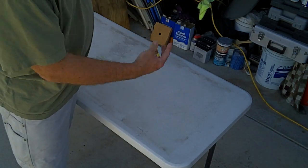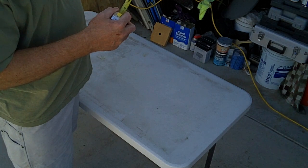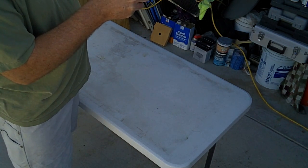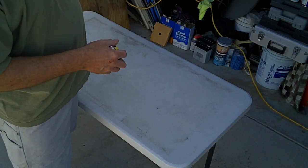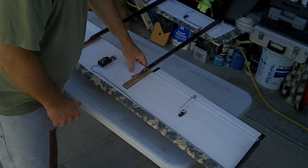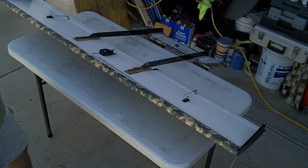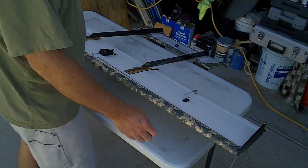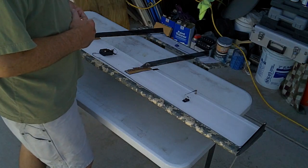If we turn this upside right, that's a kind of a wedgy shape. It's about 3 inches. It can be a lot less. It could be 2, 1.5 inches, something like that. But the reason that they're there is because this is a single, a tandem style landing gear set, and so the tips will drag on the ground, and the tip skids there, and they're plywood, and they're just designed there to take up that pressure.